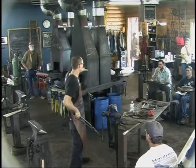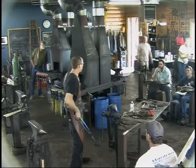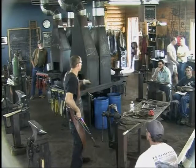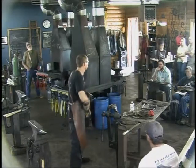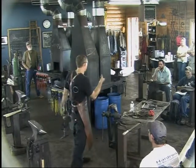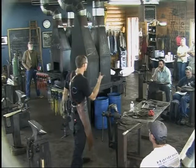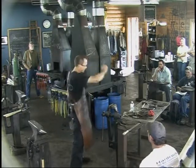If you have a gas forge or coal forge, light it, let it soak and get nice and hot to about a red, and shut it off at a dull red, not too hot. Chuck them in there, walk away for 15 minutes, come back. It'll heat slower that way. It'll slowly heat until it's above 500 degrees, 700 degrees. Turn your gas back on.